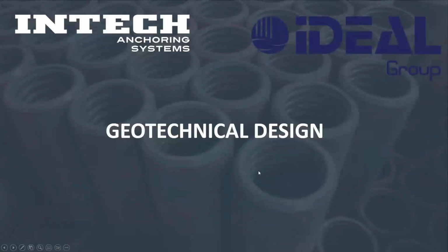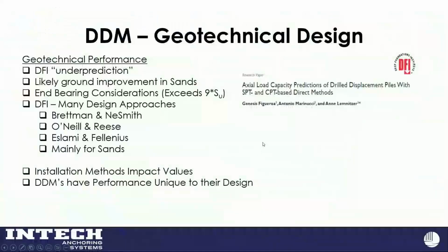So that's the basics of the structural design: axial, lateral, pretty straightforward stuff with commercially available software. So the geotechnical design was a little more challenging. Originally, we were using some stuff based on load tests and things like that. And to me, from a design standpoint, I really wanted to have a good reference I could point to. The DFI, the Deep Foundations Institute, did a pretty cool paper a while back on specifically drilled displacement piles. They might have had 12 or 15 different ones, and they went through all these load tests and tried to figure out what the best way to predict capacity was.